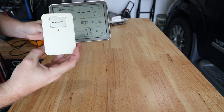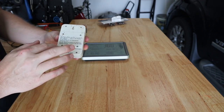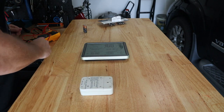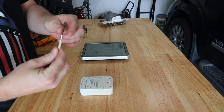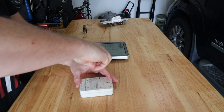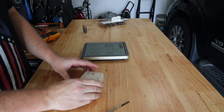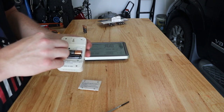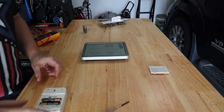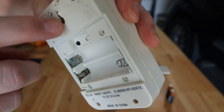I'm pretty sure there's something wrong with the temperature sensor - there's no LED lit on it. So I'm going to take it apart. You have to remove these four screws to get the batteries out, then inspect the circuit board. I'll use my little precision Phillips screwdriver here to remove the battery door screws. There's also a gasket around the battery door that keeps moisture out. There's some corrosion - you can see the copper's turning green inside, so water has been penetrating through that battery cover.